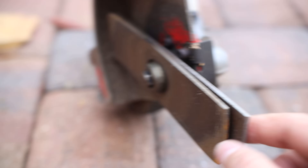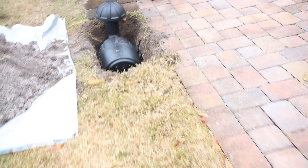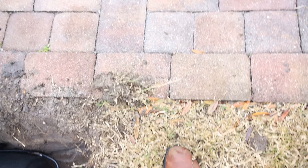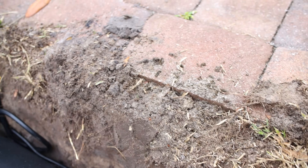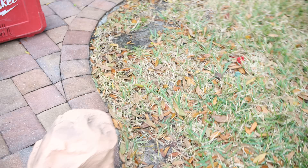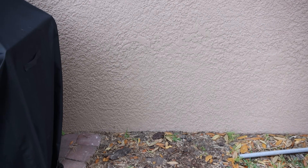One thing I've done is installed two blades on my edger. My plan is to use my edger to cut my trench for all the cables. We're going to come out about right here where my toe is. You can see down here where the footer is for this patio, so we need to keep it out from there a little distance. But if we do it right through here along the path, I always know where my cables are. So I'll just follow the path with my edger all the way over to where we're going inside the theater room.